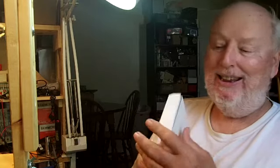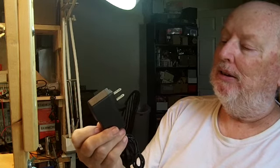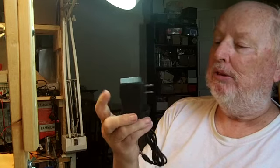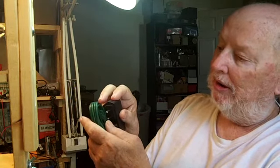Yeah, I know, they're white boxes. That's real special, isn't it? And if we look inside, we're going to see they are small AC adapters. 9 volt, 1 amp is what they're rated at. I highly doubt that they're going to put out 1 amp. But anyway, that's not what I'm interested in. I'm interested in something to power my meters on the AC there. And the idea is to take this, put that together with that, and there's one on the other side, and I think all three of those will fit in that case there, I'm hoping. Now, the possibility looms that I may have to get some 9 volt regulators if these things are wildly over voltage. So that's what I'm going to be doing, is checking the voltage on these in a very short while. And for that, we're going to need to switch to the other camera.